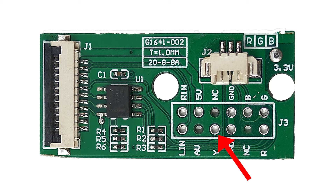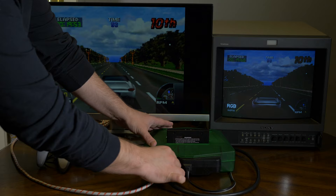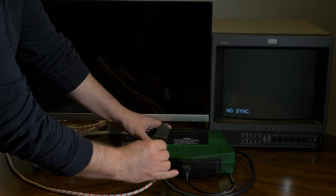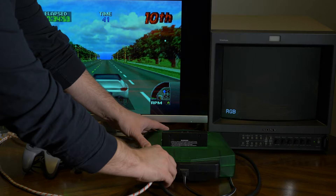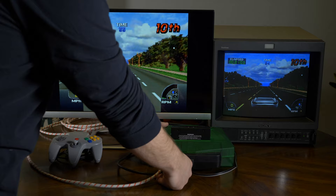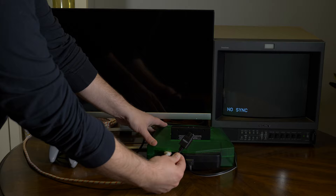If you see the first board with a specific pin soldered, you can't use RGB or S-Video in either single or dual output scenarios. If you see the second board with the pin next to Luma soldered in, that means they used some prototype boards in production, and you'll have to run one more test. Connect the HDMI output of the Warrior 64 to one monitor, then connect composite video to another. If you plug in composite video and the HDMI output gets darker, you shouldn't use the analog outputs at all. If Luma is used as sync, you won't see a brightness drop if you plug in an S-Video cable, but you'll probably see the InTech board lose signal when you unplug it. This dual output test is still a decent way to test this board without opening your console — but I'd still suggest doing both, just to be sure.